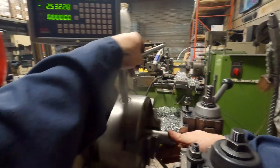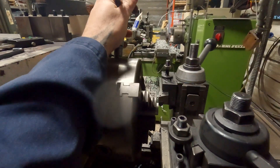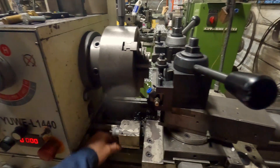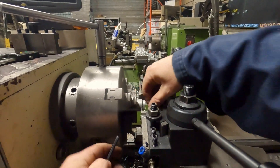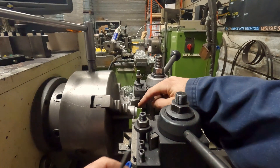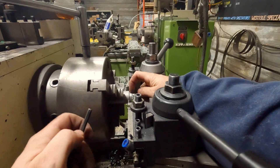So we've got to set up the cut. Got to stop here to set our Z travel, which will stop probably right around here — leave about an eighth of an inch or so. I've got a bit of a distance, about a quarter of an inch offset between the turning tool and the part-off tool, so that when I go in with the turning tool and make this step, I can just go straight in with the parting tool and it'll leave me this quarter-inch step.